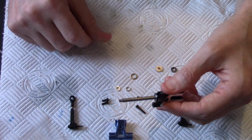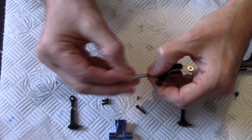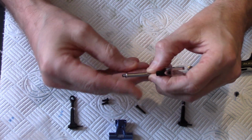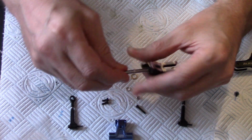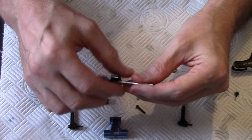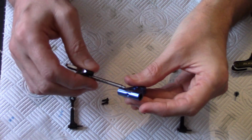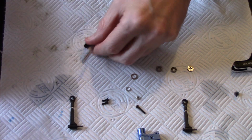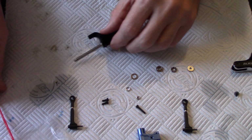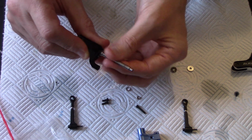Now before we go any further, you want one of them little silver washers. Now slide that on, because that's on the inside. Whoops, that goes on the inside, and it's a snug fit, it'll just slide on and that locks into there. And when this bit gets applied, which we'll do now, we'll push the head, this is your feathering shaft, and we're pushing it straight through the thrust bearing. And I'll tell you what can help actually. You don't always have to, but if you put just a tiny bit of grease on your feathering shaft here, it will help.